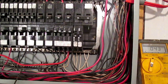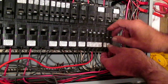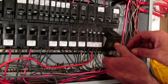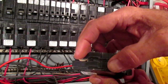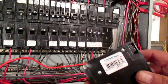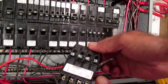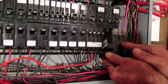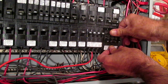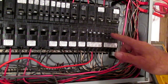I'm going to remove our two mini breaker circuits here. These slide in on the bottom to a groove and they should come out fairly easily like that. As you can see on the top are the clamps that go into the bus bar. Down here they just slide in. So when we put the new one in, we're going to put this in first and then push up. There's our new breaker. I'm going to set the bottom into place on the bar that runs along there, and then with all my breakers off, push that into place. There we go.